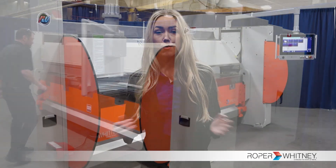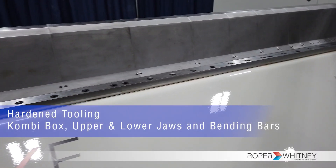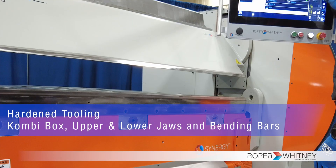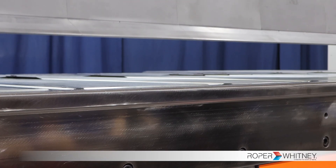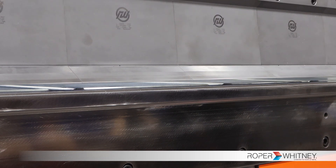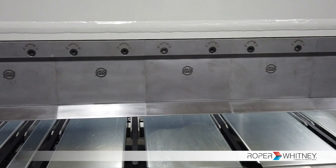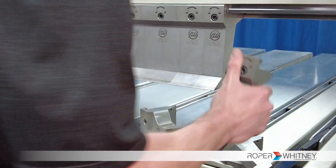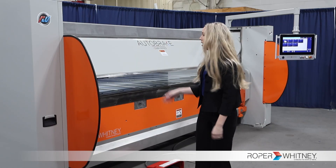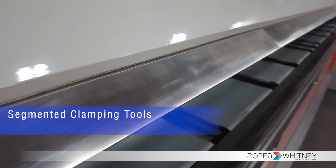The first thing I'm going to start with is the tooling. All tooling on this machine comes standard as hardened tooling. This includes combi box tooling, upper jaw, lower jaw, and bending bars. Hardened tooling is important because it supports longevity. The hardened combi box tooling is 6.3 inches and it is designed for rapid setup for minimal downtime. Another feature is that both clamping tools, the upper and lower jaw, are segmented for easy replacements.